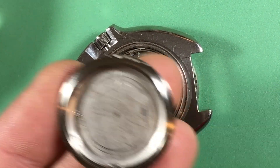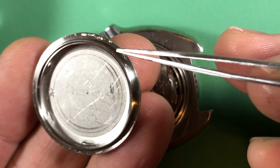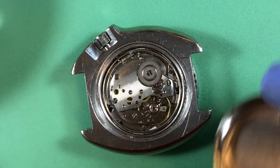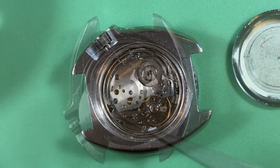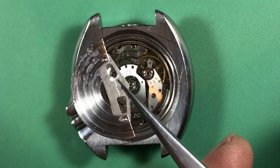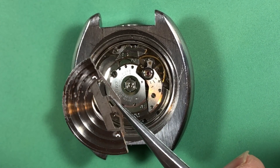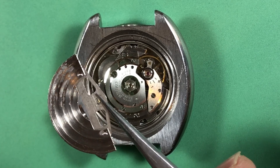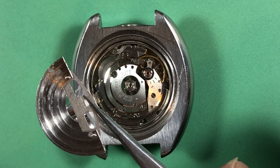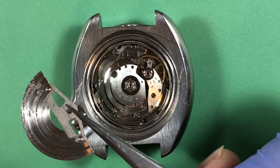On your case back you have some areas of pitting from the corrosion — nothing major. It's not on the hardcore sealing surfaces, but be careful. You will remember that your winding weight had what I called whale snot on it — there's the pitting from that, but the metal underneath is pretty solid. That came off, and normally I would advocate replacing this, but I'm not going to do that. I think this is okay — I don't want to put any kind of sealer over it because that could come off in the movement.